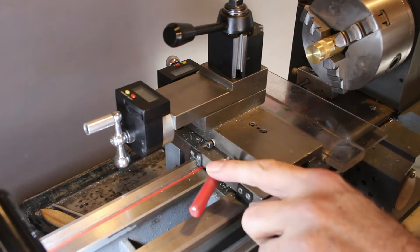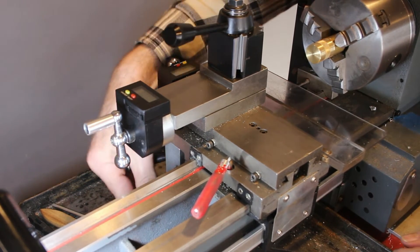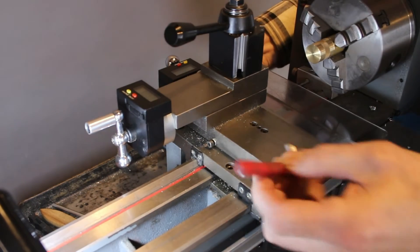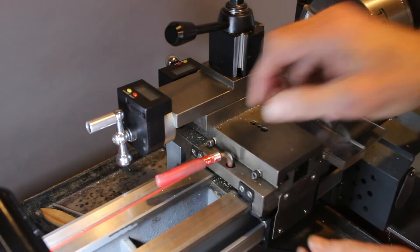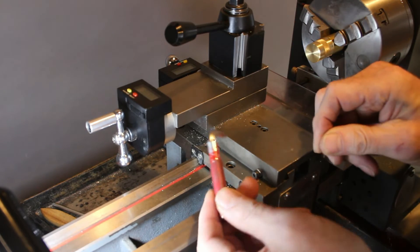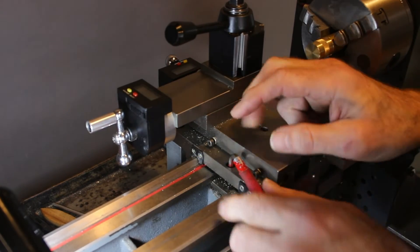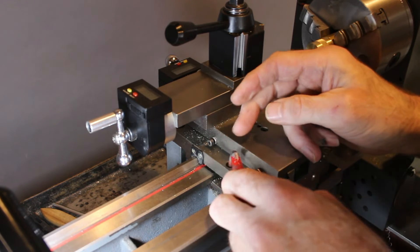Another thing that I made is a carriage lock. If you try to just use the locking nut on the lead screw and lock that down, you've still got some wiggle room and that's unacceptable — you can't really use that for accuracy. So if I unlock that and shift this over, that actually locks the carriage absolutely immovably. The way I made this is there's a plate that goes all the way across that is threaded, and a cap screw is buried down into there. This is removable because you want to be able to have the cross slide move past this if you need to. This is just a modified Allen wrench that I put a handle onto with some plier handle dip, and I machined an aluminum tube to go over it, then put some plastic dip on there to make it easier to see — so it's red.